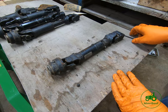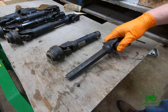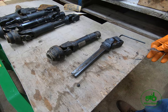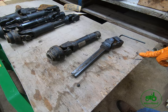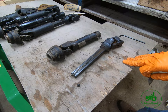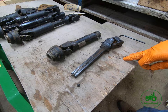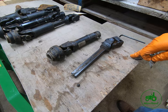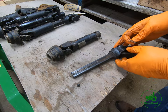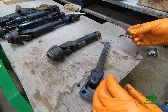Set them aside — they're small parts, don't lose them — and then pull it out. Now you've got your shaft apart. I generally do this on all of my mower deck drive shafts every other year, because all the crud and debris from mowing gets stuck in there. As I've indicated in earlier videos, drive shafts are expensive, and there's no reason that in a couple thousand hours of mowing or snow removal you should need to replace one. Theoretically a drive shaft is a one-time purchase, as long as you maintain and keep them greased.